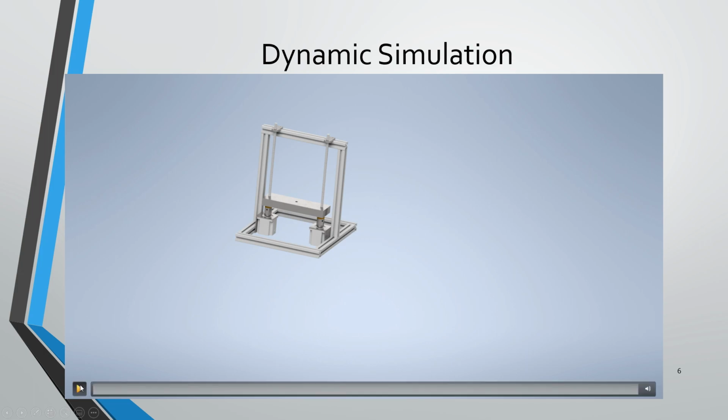So showing you this video, basically we applied a center load right here, and this center load was in tension and in compression. As you can see from the video, we moved it up, and then we moved it down. So in this specific video, we were applying 500 pounds force, and we were also applying the max NEMA motor torque that was specified on the manufacturer's website. So both motors are applying a torque, and also we're applying a force axially right down the middle.